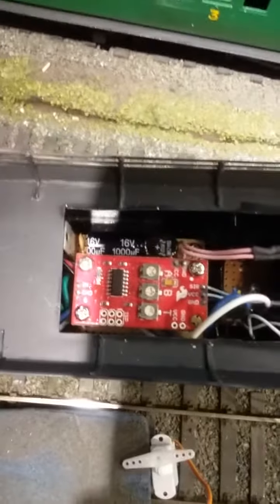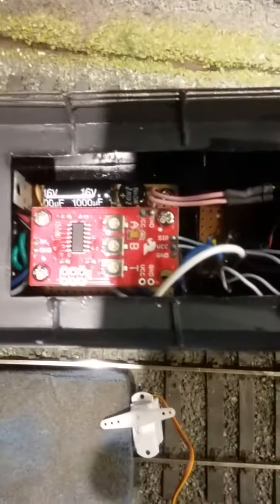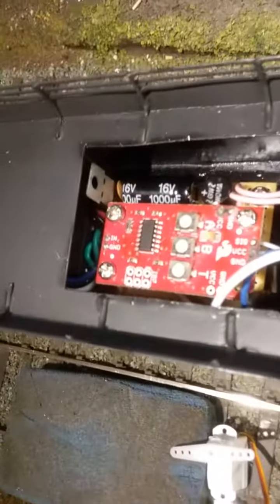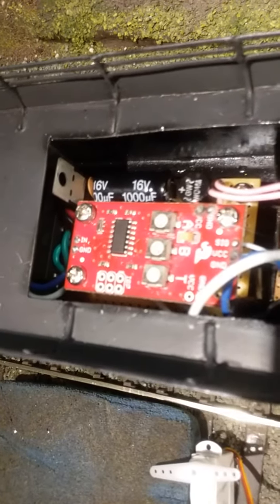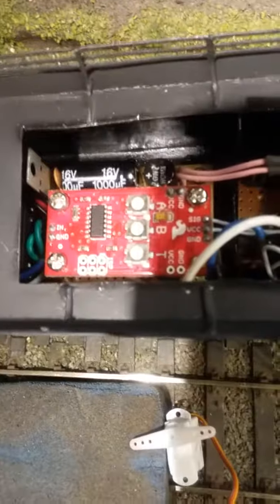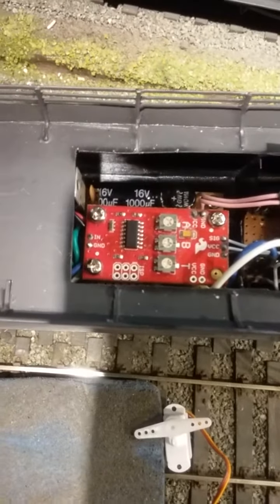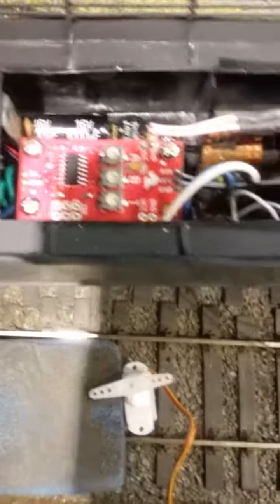Through a circuit to the side of the red board, you can just see the capacitor, and at the back of the tender you can see the voltage regulator for five volts and the smoothing capacitors. That produces a smooth five-volt voltage input into the red board. Done.